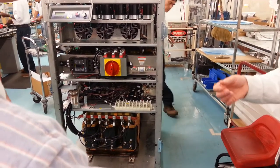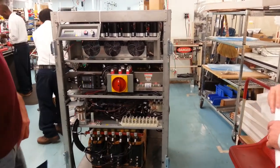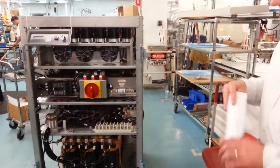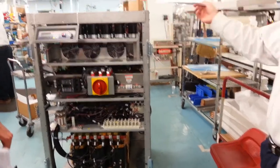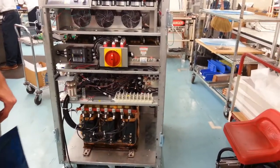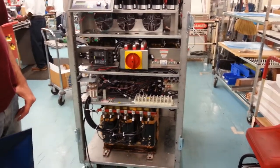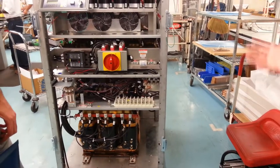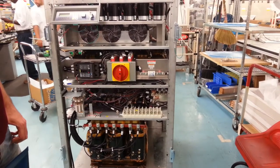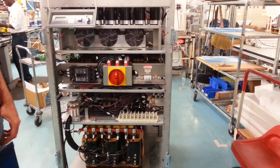That's when the batteries will phase in through a DC chopper circuit — that's on the side here with IGBTs. You'll actually drop the input if you get outside that plus 10, minus 30% window, and it'll do a DC conversion. The DC bus is actually 400 volts. The batteries will be nominal 270V, down to a 230 or 200 volt cutoff. As a battery chopper, that'll take that low battery voltage — as you decrease the battery voltage, the current increases — but that chopper keeps that 400 volt bus regulated.